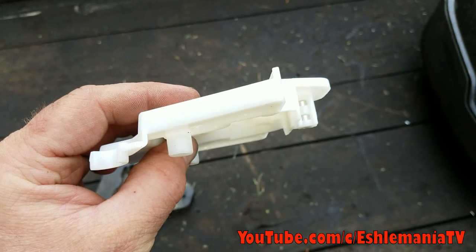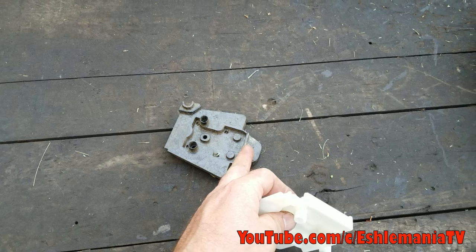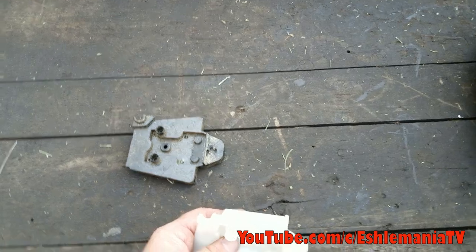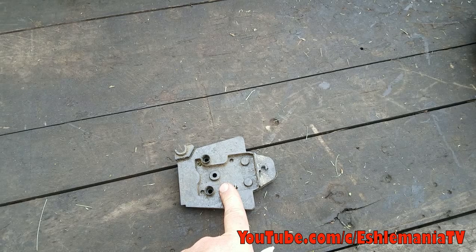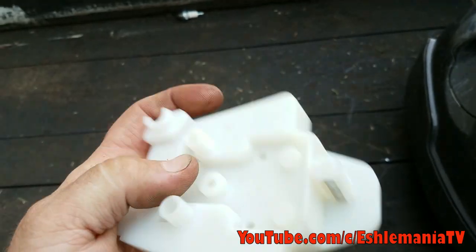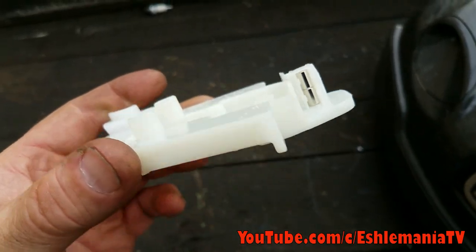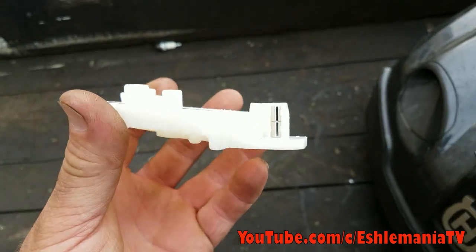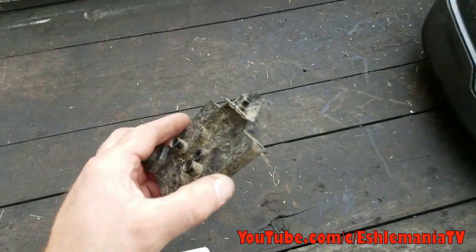If you look under there and you already have the white plastic magnet holder, or your magnet is still in your old black one, there's a possibility it might have got flipped upside down — you know, if somebody was playing around with it. Even if the magnet is still in there, it's still a good idea to upgrade to the white plastic one. But if you have the white plastic one, both magnets are in there, it's not broken, and you're still having that active collision sensor fault and the mower won't run, then you need to take it to the dealer because they're going to split it open and check out some stuff inside.